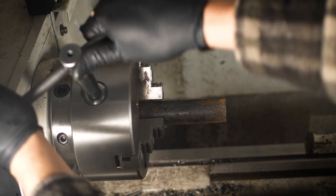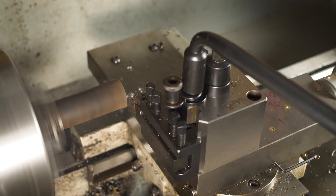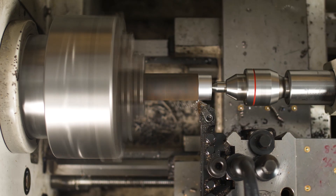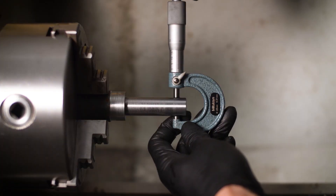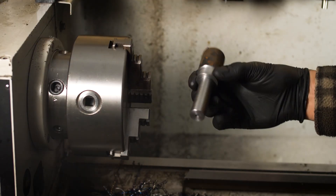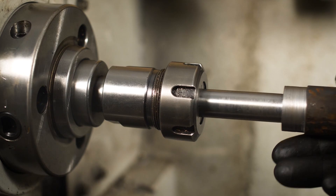The main tool body will ride back and forth on a guide shaft and I'll make this shaft first. I'm just going to be using the mild steel I have on hand. I turned the guide shaft first and marked at multiple locations to confirm I'm not accidentally turning a taper. To maintain concentricity when flipping the part I mounted it in a collet chuck and roughed this end for the next operation.